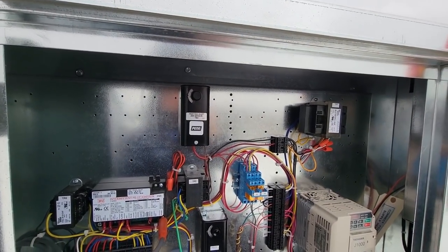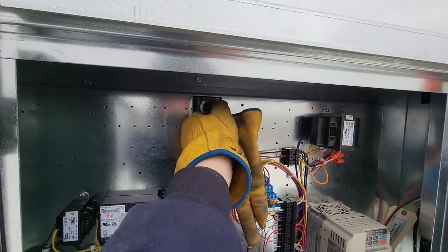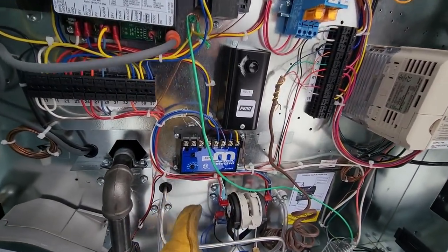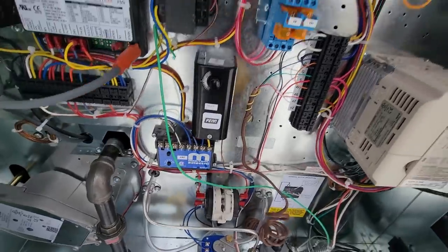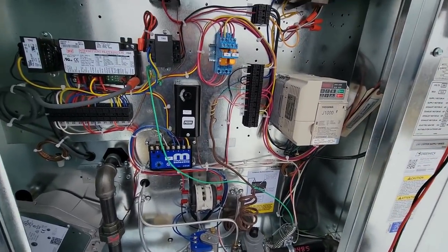I've heard 50 or 55 degrees so we're going to leave it — maybe 65 is the better spot. This setting here is going to adjust our discharge air temperature, which usually I like to try to make it break even with whatever the room temperature is. Let's go down there, turn the fans on, and see if this thing calls for heat.